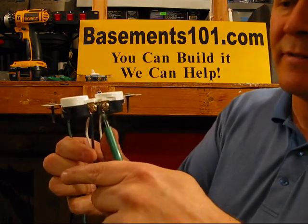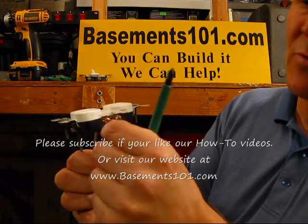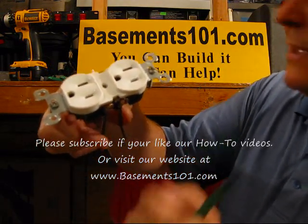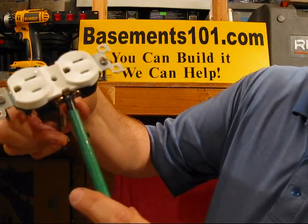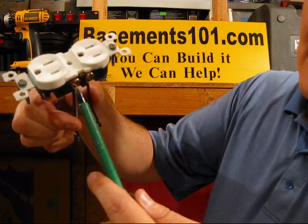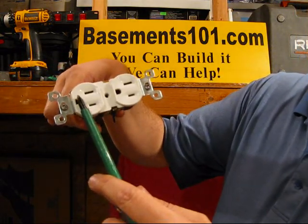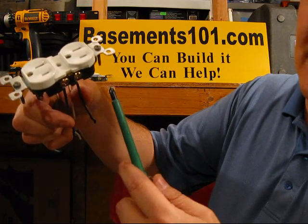This little tab is called a breakaway tab because what you can do is — there's a small brass tab here on top — that can be removed. You can take that off with a pair of pliers. When you remove that, you no longer have a connection from this side to this side, so if the power is coming in on this side, only this side of the outlet will get power. This side will not get power because there's no way to take the current through to it.